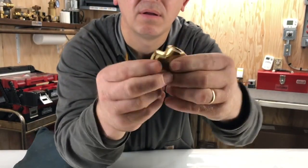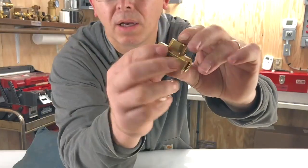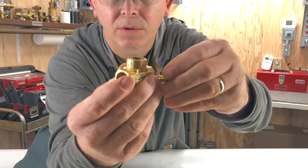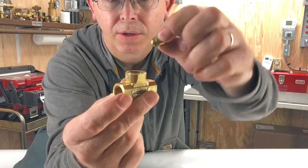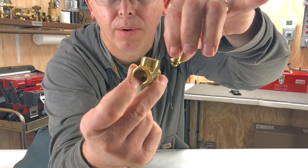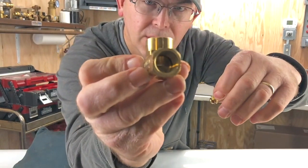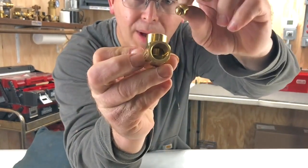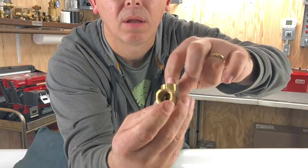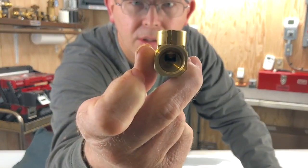We have an arrow on the check valve so the fuel goes in this direction. Fuel goes in the bottom, which is underneath the plunger, and the plunger pushes down so no fuel can go through this little port and come out through the other side. You can see inside — I'm going to put this plunger back in and you can see where it goes inside. There you go, as you can see it's visible inside.